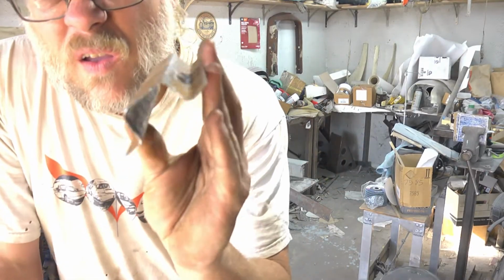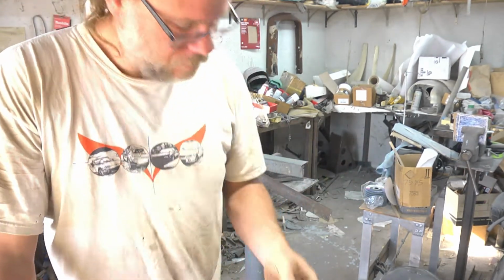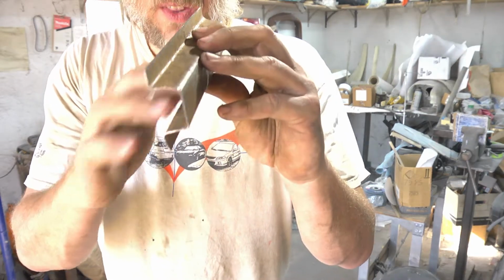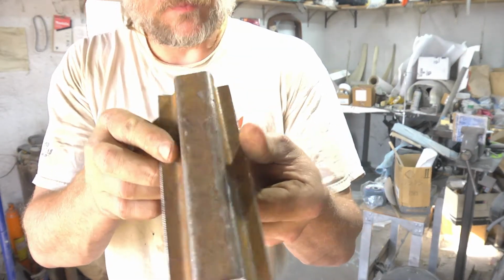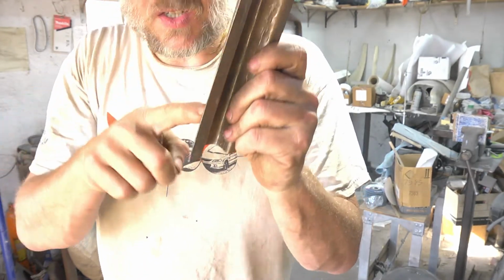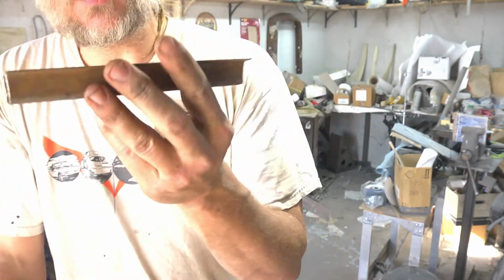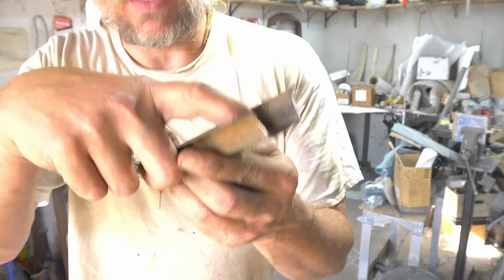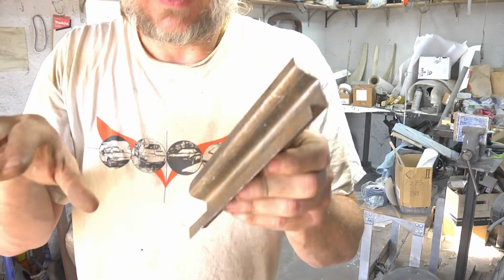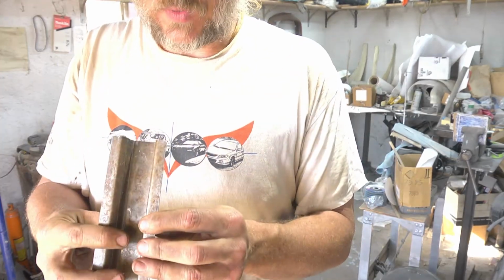Okay, got my channel made, correct length. I'm going to tighten up these bends a little bit, flatten it out a little bit on the anvil, clean it up, punch some holes in it for welds on the flanges, and then it'll just be a case of figuring out where it's actually supposed to go, which is going to require me bolting it down with some carriage bolts onto the truck, fitting the rest of the step, pulling it off, and then finish welding it.